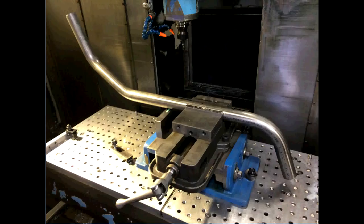Let's take a look at this piece of tubing. I've got to drill a few half-inch holes on the top of it, and there are a couple of issues. First, I've got to pick up on the center line of this tube that's on an angle. I've got about three or four of these to do, so I'm going to set up a little stop so I can just slide them in, rotate the pipe correctly so it's perpendicular, and pick up the angle correctly each time.